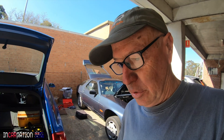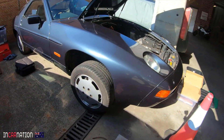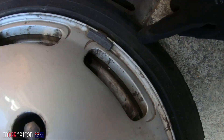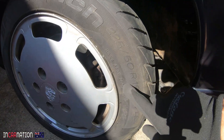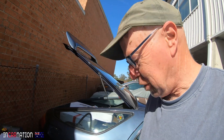As I'm sure you know, tyres don't last forever. Seven or eight years is about the limit, and you actually don't want them sitting around on a shelf in a shop for more than about 18 months to two years. Let's just see what we've got on here. I really like Continental tyres, and these are Conti Sports, which are a great tyre — unless they're 30 years old. Made in November 1994. I think that's a bit old. How about the backs? Oh, positively new — made at the end of June 2001, so they're only like 23 years old. Nonetheless, they're all going straight in the bin.